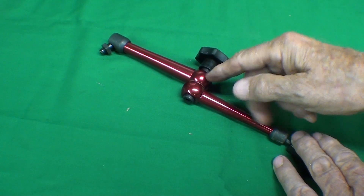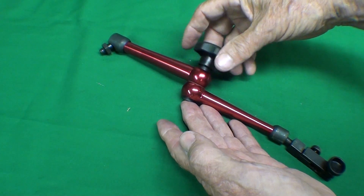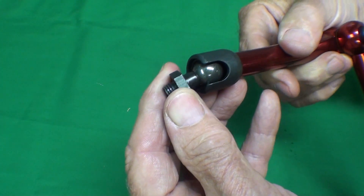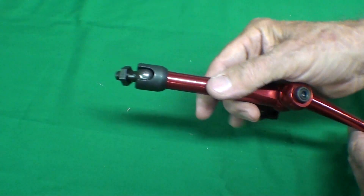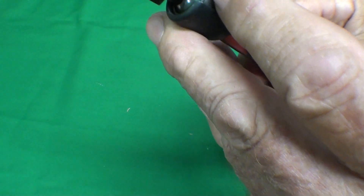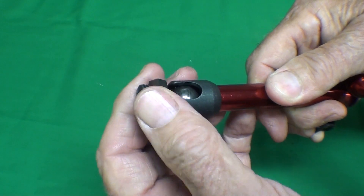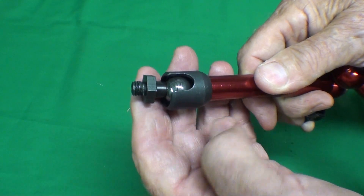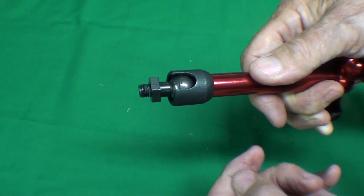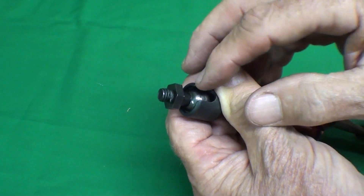So when you think about it, this joint right here — and there are three joints — is a very simple one. It's just a matter of friction, a nut and a bolt tightening it up. But how do they transmit that force to the ball? There's a ball down here and a ball right here. I've got to take it apart to show you. I'm going to start by taking this ball out of here, and it's kind of tricky because there's a retaining ring in there — just a piece of spring wire — so there's no place to use retaining ring pliers or anything like that. It's just a matter of trying to work it out without losing it.